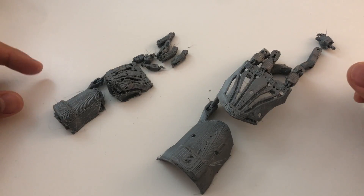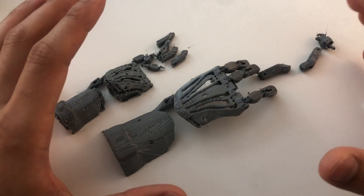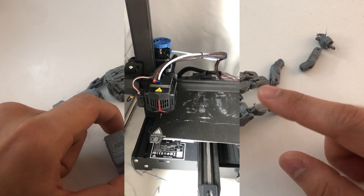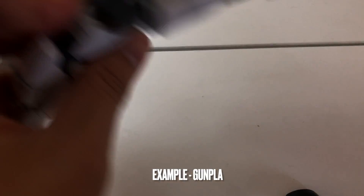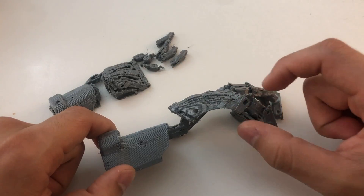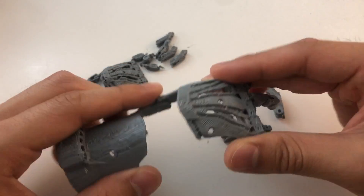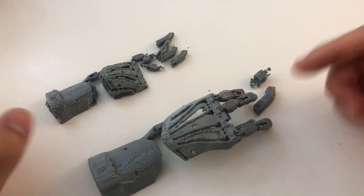This is a 50% scale version of Cyber Beast and this is a 70% scale version. Since I use a 0.8mm nozzle on an FDM printer, the quality is not good enough to be assembled and usable for actuation. I'm trying to build a toy version of a robotic finger for STEM education, but the printing quality isn't sufficient right now — the pins aren't printed well and the joints need higher resolution to work.